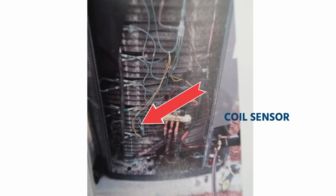So we're talking the side panel near the reversing valve? Yeah, on the side panel near the control panel where you can see the reversing valve and everything, the middle pipe that goes to the common suction is going to be the little port. You put your suction line on that and you leave your liquid line connected to your liquid line port. The metering device is well within the machine, well away from that. So you actually do have subcooled liquid coming back to the outside unit at that point, and the hot gas, the same way, your discharge goes inside.